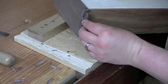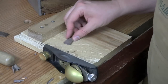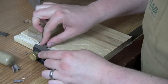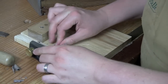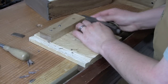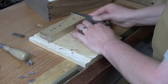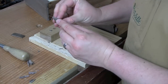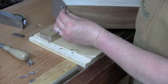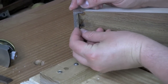I want to grab my drawer and see if this can slide into the gap. First, however, I want to get a nice straight edge on the wedge. So I'm just going to hold it up against the fence and kind of use this as a little bit of a shooting board — actually, let's do this on the other side. There — nice straight edge on that now. So it will track up against the wall without a problem. What I want to do now is slot that end so it sits flush up against there.